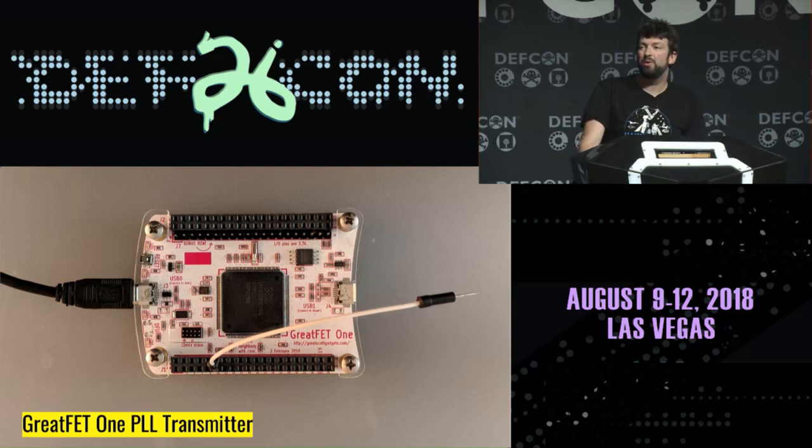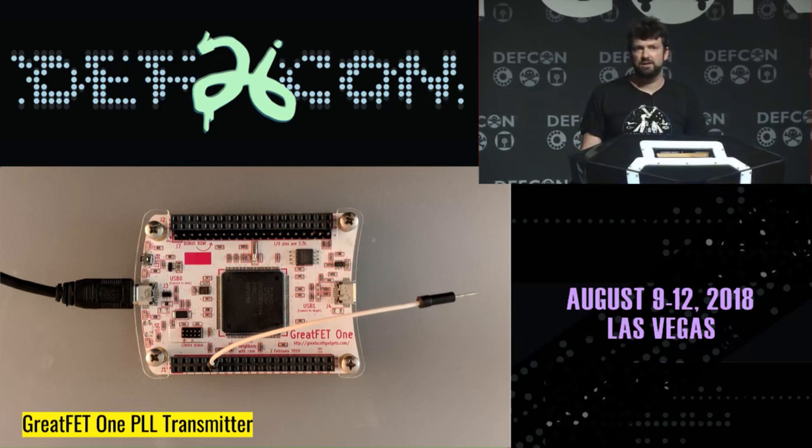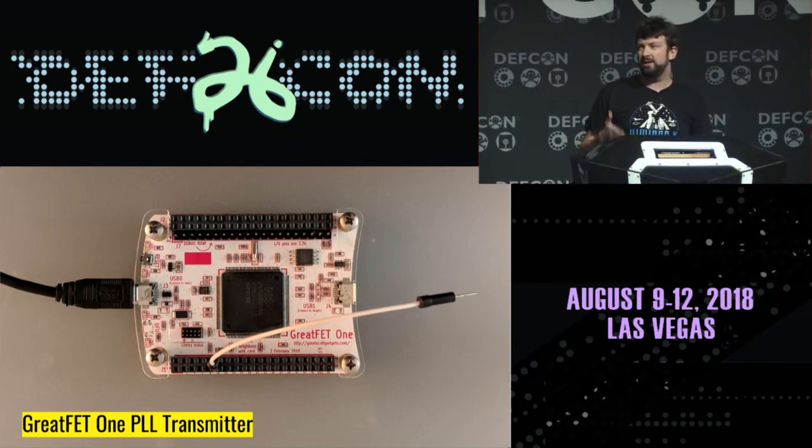So what we want to do is frequency shift key data, and we have two options here. One is we can take those clock generators and very rapidly try to reconfigure them. That's what Raspberry Pi FM does, but we couldn't get it to make very clean jumps back and forth between our two frequencies that we needed.